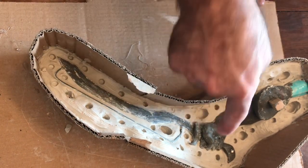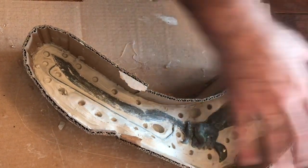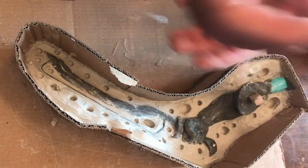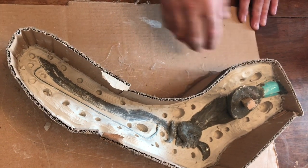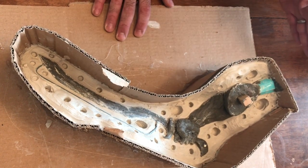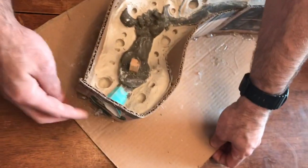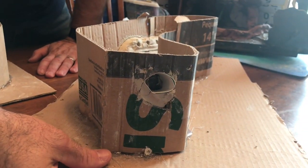And if you notice, I make these little key registry holes. When we pour the silicone into this mold, those are going to set into those holes and they're actually going to be keys — so when we turn it over, it'll have somewhere to sit into. You'll understand that process next video. And then one more thing: when you have a figure like this, you need a place to pour your material — your casting, not silicone, but your resin. If you look right here, we have a spout where we'll pour our material in later.